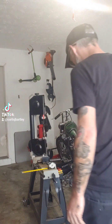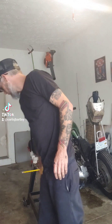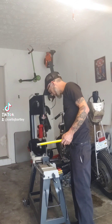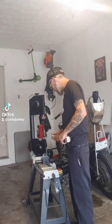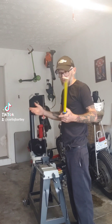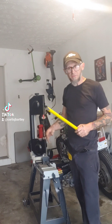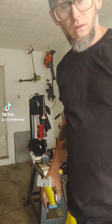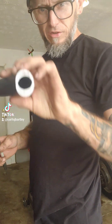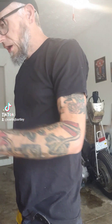Got one end cut off there. I'm going to measure it up here on the bandsaw and cut this to five inches, because those bars are three and a half inches on center, so four and a half to outside — but we'll add an extra half inch so we've got a quarter inch on each side of the risers. It's cut — here's the five-inch piece. This will be the crossbar, the top part of the riser.